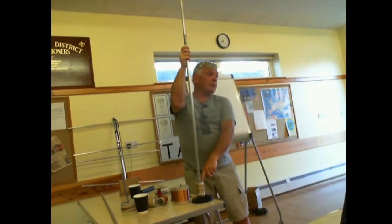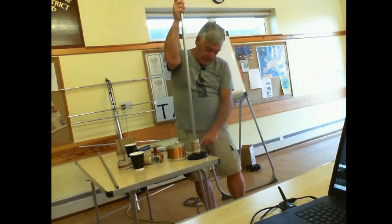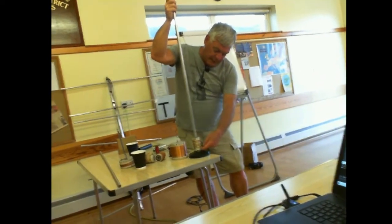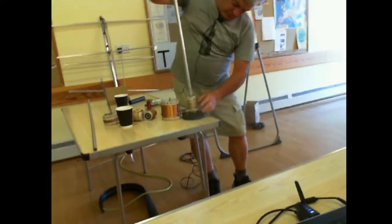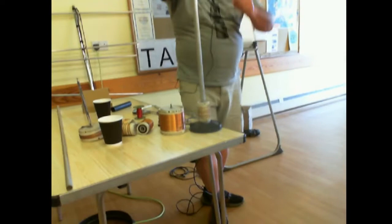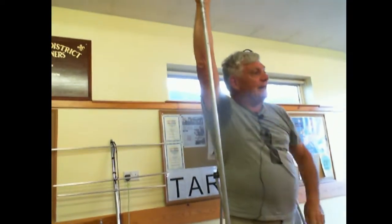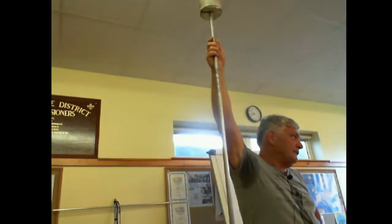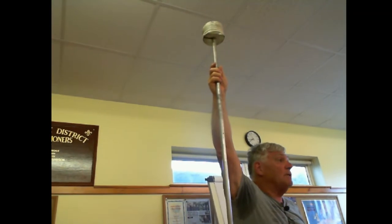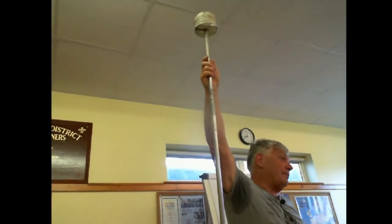Down here, we have the matching coil. This is where you find 50 ohms. So, this is fed from the base, and inside here, there's a tap point, probably somewhere up here, that makes it 50 ohms. This is a 40 metre antenna. So this has got to be quarter wavelength long. This has got to be 10 metres long. And at best it's going to be 2 metres.